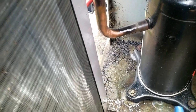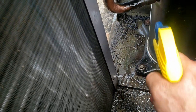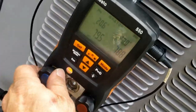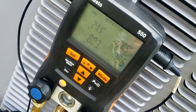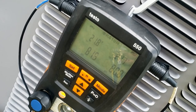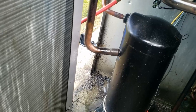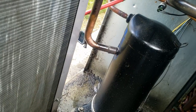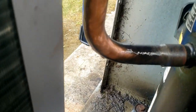This is a weird leak. I went ahead and pressurized it with about 70 pounds and it's not even showing up. Grabbed the ultrasonic — can't hear it either. Going to have to pump it back up higher. That's wild that it would require that much pressure to start showing up. I was sanding it off with the wire brush wheel and it must have brushed right over the hole — it must be such a small pinhole that it just sanded right over top of it. It's finally starting to bubble, you can see it right there.